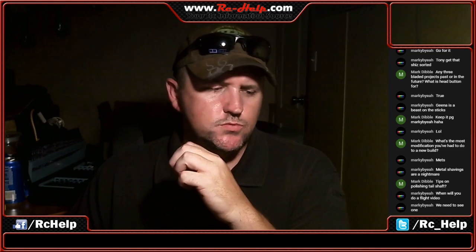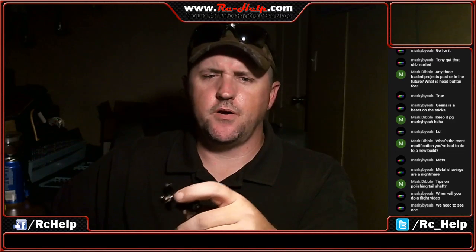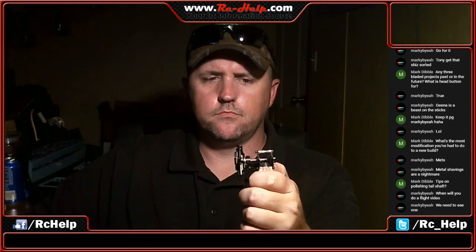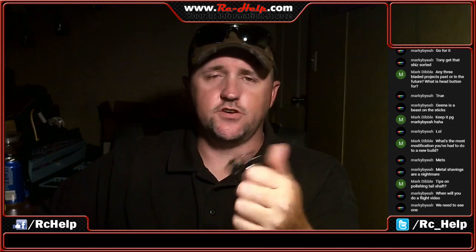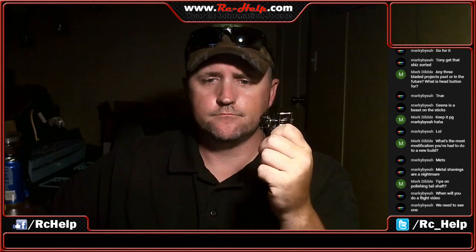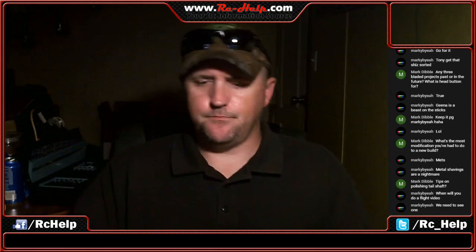Tips on polishing a tail shaft. Are you talking about that shaft right there? What'd you do that you need to polish it? Chuck it up in a drill and grab some 1500 to 2000 grit and a little bit of water. Basically wet sand it.